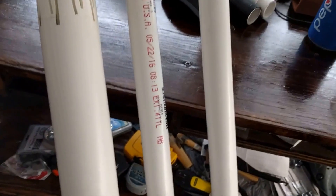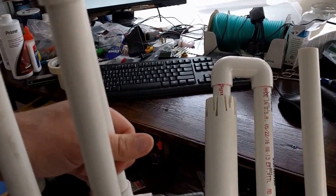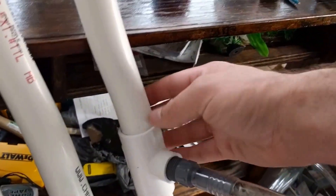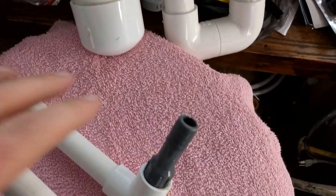This was my first one I made, and I realized if I rotate it 90 degrees it has a much smaller footprint — most of the piping goes off to the back the way it should. You want twice the diameter for the standpipe as the rest. This is one-inch, with two 90-degree elbows and a T with a connector to the hosing — a one-inch T that goes to a half-inch threaded hose barb and on down into the drain system.